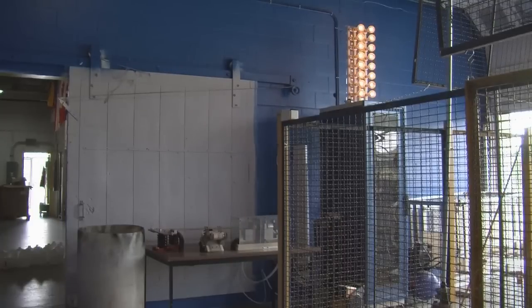I'm just crossing 900 volts now, and you can see the bulbs are very dim. At some point, the capacitor bank will be nearly fully charged. The bulb should be just about out by then, because there won't be enough voltage across them to actually light them. We've just crossed 1300 volts, and we just have a dull glow out of the lights. Crossing 1500 shortly now, and the bulbs are just going out. So there's a good indication. When the bulbs go out, you're north of 1500.